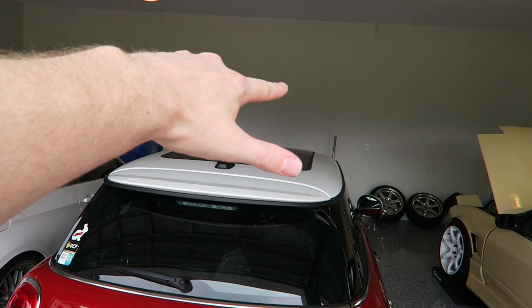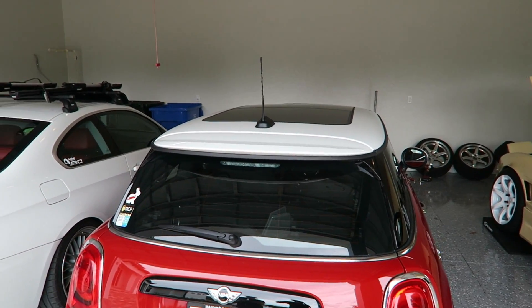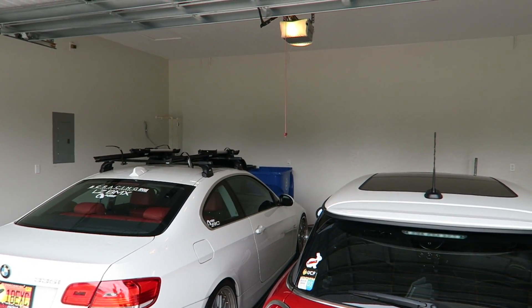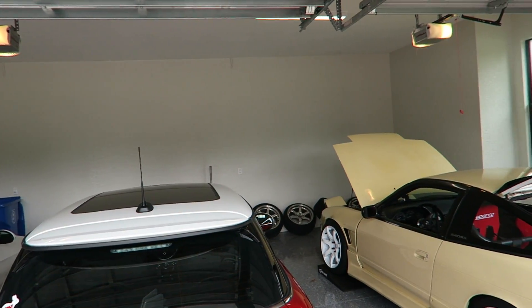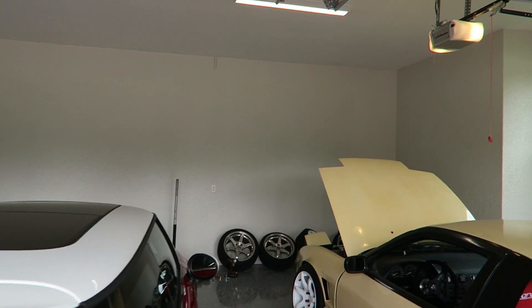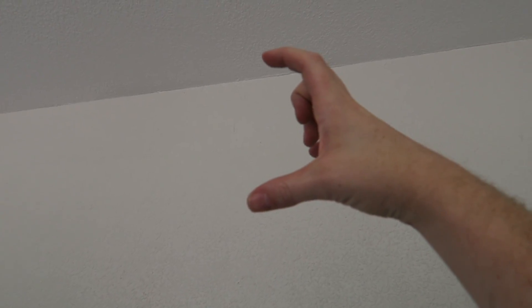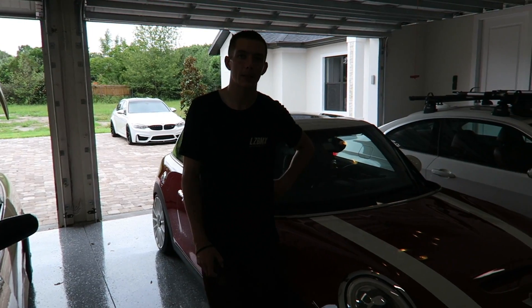We'll do Saber Cabinets and I'll show you some design on the computer. We'll probably want to do multiple fans in here — three or four fans. The issue on the block wall is that you'll see the wire, so we'll have to mount the fans rather high. Since the fans will be so close to the ceiling, the fan canopy will cover most of the wire. We'll have electrical outlets put in and it'll just run up the wall and grab the ceiling — it'll look good.